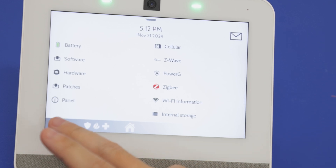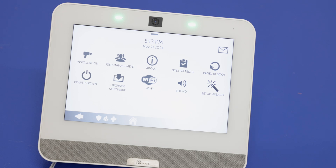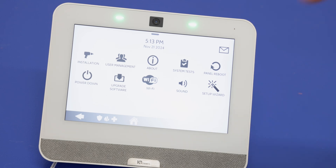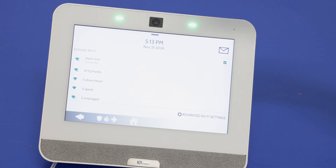When you have the IMEI number and you contact your monitoring company to get this registered, there's not really much you need to do on this end — they can get that connected. Once registered, that's when the signal strength and all that information will start showing. You do have the option to connect to Wi-Fi, though it's not necessary; the system works fine off cellular only. But if you want extra security with the signaling, the Wi-Fi option is there. If an alarm goes off, both the cellular and Wi-Fi paths will send out the signal at the same time, and whichever is quicker will arrive to alarm.com first, which will then notify your monitoring company.